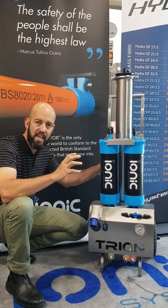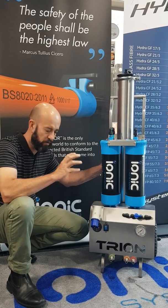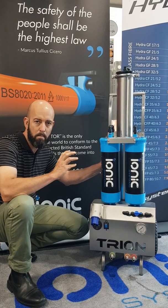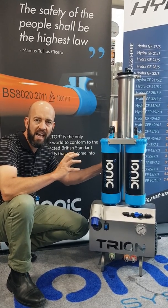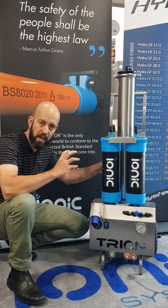The caddy softener or caddy softening resin vessel will require ongoing maintenance, and that's a back flush of that resin vessel or caddy every 8 to 10 hours with salty brine water, which will rejuvenate that resin.